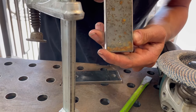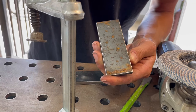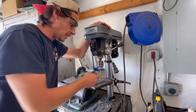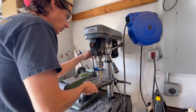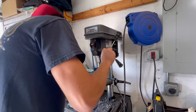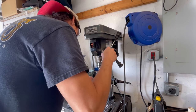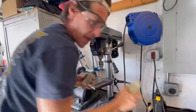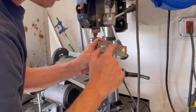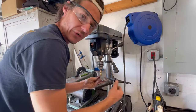As you can see, our hole's lined up really well. We've got our two dots right there that we can use as our drill guide. We're going to bring this over to the drill press and drill it out. I've just got one of these cheapo Harbor Freight drill presses — this thing works out fine for what I'm doing here. I don't really need anything bigger or better than this. What I like to do is fire up the drill press and just score it. I do that on both sides. Then I go ahead and get my cutting lubricant and give it a dot. The reason I do that is because you kind of lose the dot inside the lubricant, but now that we've scored our holes, we won't lose the dot — the drill will find its own way.